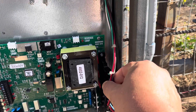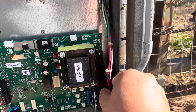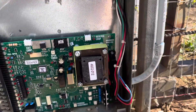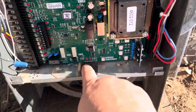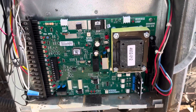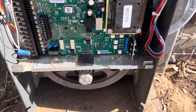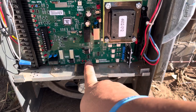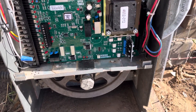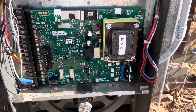I'm plugging this in — it should be a direct connect. There it is, direct connect made. You'll notice there are sensors in here as well. They're making contact with the magnet as it turns, counting based off that rotation. These are newer LEDs — only three millimeter versus the bigger ones on the old board. Let's power it on and see what she does. We've got an LED power light on.